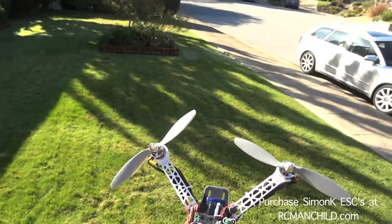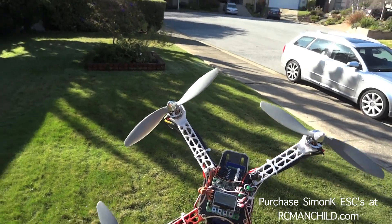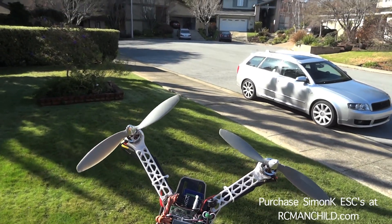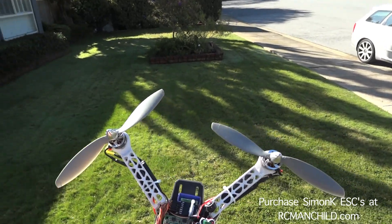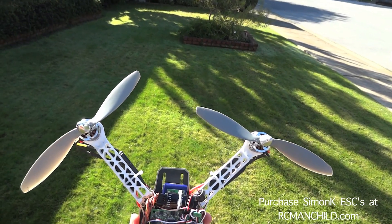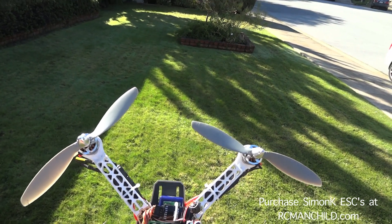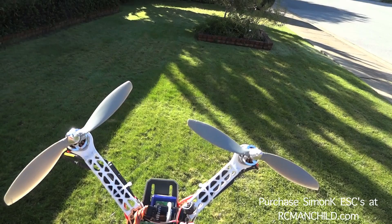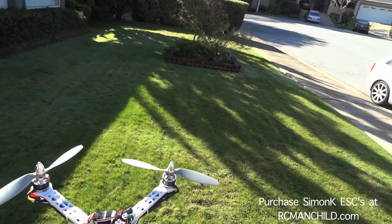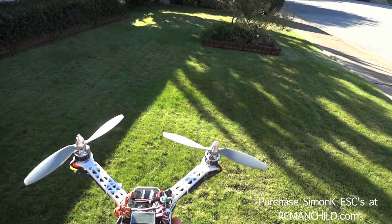So here we are a couple days later. This is exactly the same quad, same motor, same speed control, same battery, same control board, and exactly the same PI settings as when I first tuned them for the original ESCs. So I'm at 50 P gain, 30 I gain — that was about the sweet spot I found with the last ones. The downside was it had a quick oscillation when I let go of the sticks.